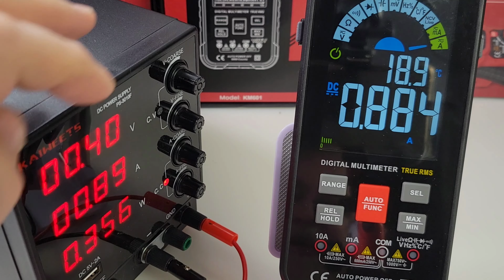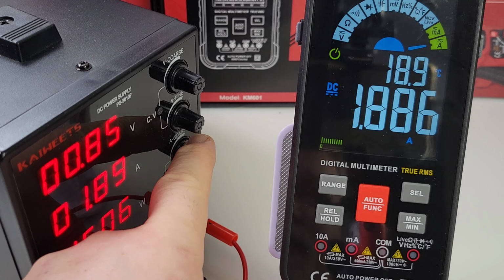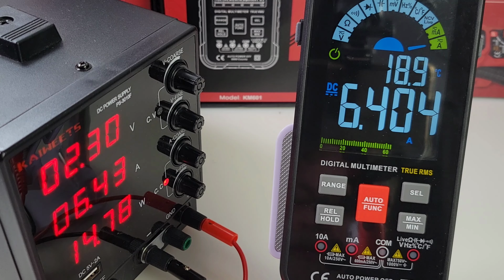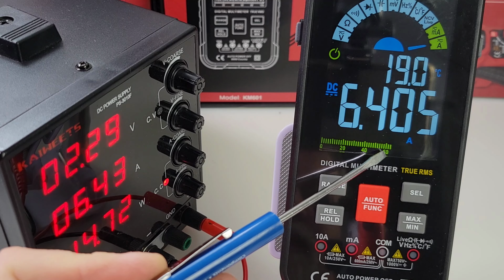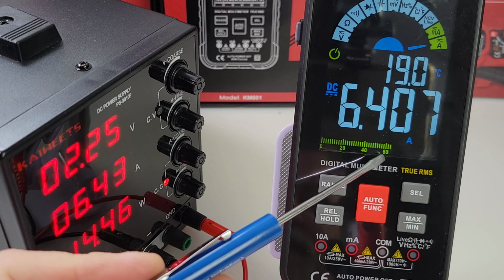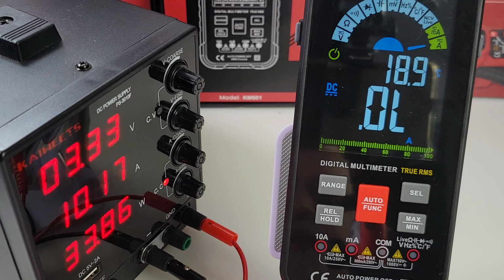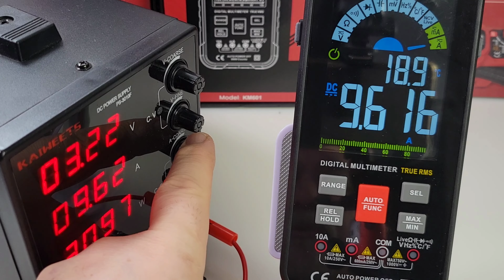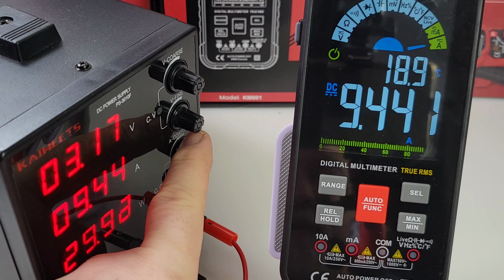You can see that gorgeous display showing us indeed we are in high current amps. Okay, let's take it up, shall we? And sitting at 1.90 amps, coming up as 1.88 on the 601, up and away. And we can see as well, we have a really nice bar graph here on the 601. So we are high current right now. And look at that nice yellow bar graph just over that 6 threshold, taking it up and away. And 10 amps, and we have that high current alarm kicking in. Awesome. Bring it down. So as soon as we hit that 10 amp threshold, boom, we have the high current alarm and we lose that display.